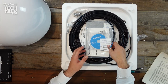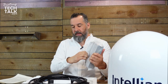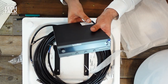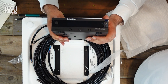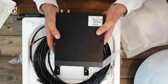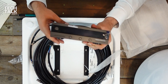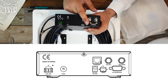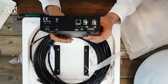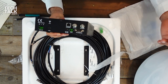When buying the i3, it comes with the manual, the cabling, and the antenna control unit — the ACU. This is what you'd see from the front, sitting on top of your satellite receiver on the boat. A set-top box is probably over double the size of the ACU. You can see the connections: power, ethernet, NMEA, a fuse, PC interface, and the receiver and antenna connections. This is the brain controlling the dish and must be powered and working.